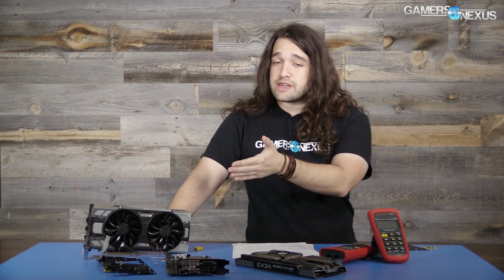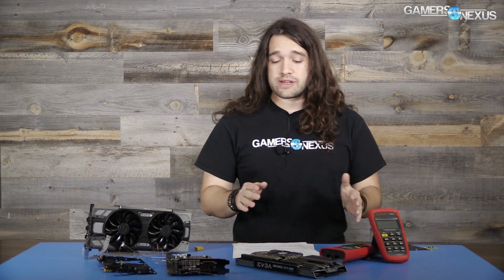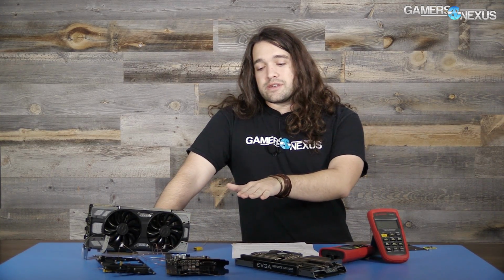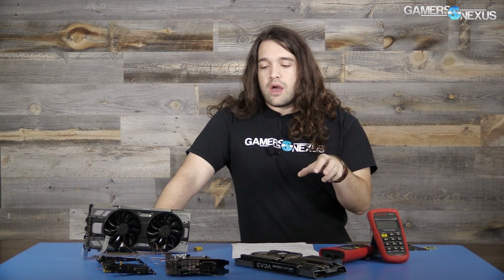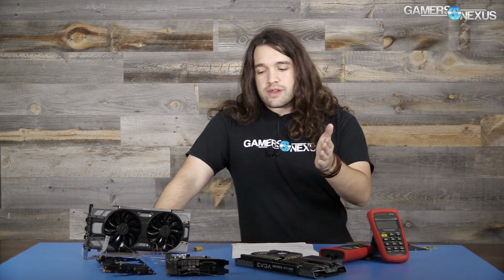Another thing that I saw that I'd like to debunk quickly was a concern that because the thermal pad is placed where it is through their recommendation, there's no air getting down into the VRM anymore. Well, there's no air getting there anyway because there's a base plate on top of it. It's physically obstructed. And not only that, the chokes where there is, I guess you could call it an air channel, are flanked by capacitor banks on one side which lead to the VRAM and GPU anyway, so that's irrelevant. And on the other side, flanked by a thermal pad which allows really no air transfer to the MOSFETs. So air can't get in there.